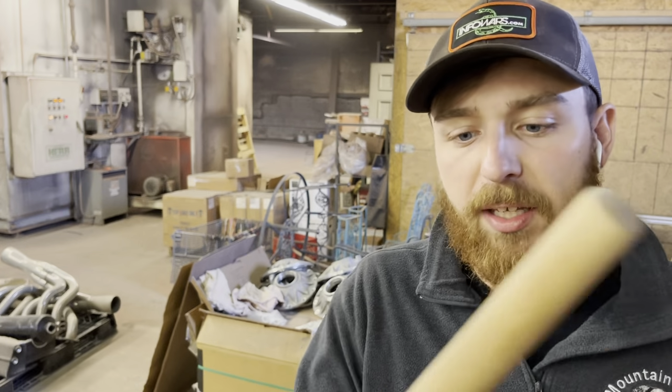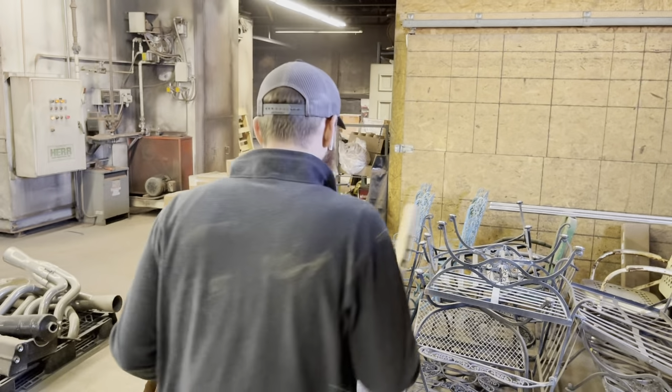The aluminum oxide puts a very even finish with no eggshell, no dimples, no spherical punches into the material. If you use like a glass bead, it'll actually put dimples all over everything, micro dimples. The finish can't make up for that. The very slight grain, the very slight grit that you get with that, the finish lays in perfectly and creates a mirror-like shine or satin shine.